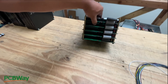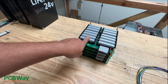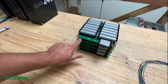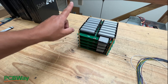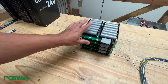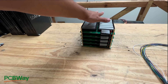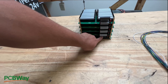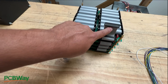These are batteries. Each one of these boards is essentially one battery — 14S, one piece, so one in parallel. And when you stack them like this, these brass standoffs will connect one battery to the next. So each one is a battery. Now you're connecting one, two, three, four, five battery modules into this bigger module, and then you connect all the cells' balance leads together using this ribbon.